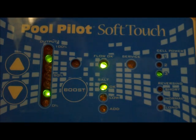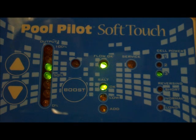The second light from the bottom is pool temperature. The second light from the top is tens and the third light from the top is ones — 78 degrees. The third light from the bottom is your volts: the second light is tens, the third light is ones. The fourth light from the bottom is amps: the second light from the top is whole amps and the third light from the top is tenths of an amp. And that is how you run the self-diagnostic on the soft touch unit.